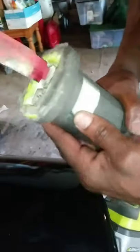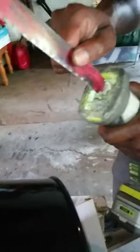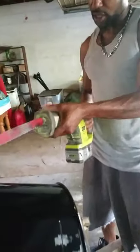And please make sure that your blade is locked in good, because that will be a problem for you and anybody around if that blade comes flying off of there at any point in time. That's very dangerous. So make sure that it is locked in. Give it a couple of tugs and check your battery. It's good power. All right.